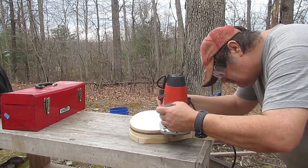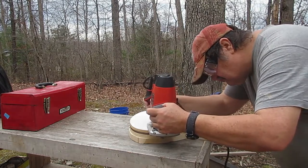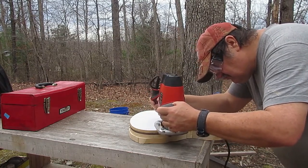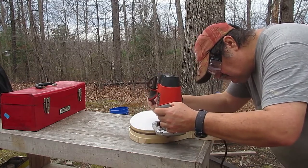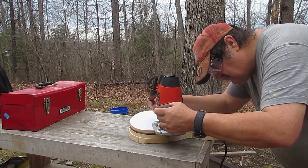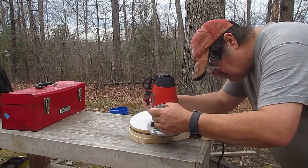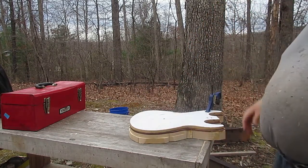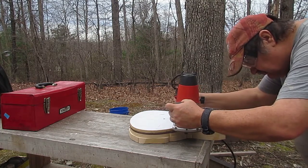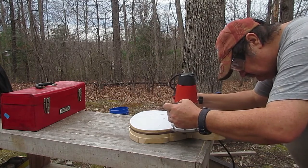This is a time-consuming operation — the nine minutes or so you see here was two or three hours of work. That's how light a cut you need to take and how slow you need to go. I did it faster on a couple of guitars but quickly found out that's not the way to go, because I got huge chunks torn out of one and had to repair it. Better to do it this way than cry about it later.